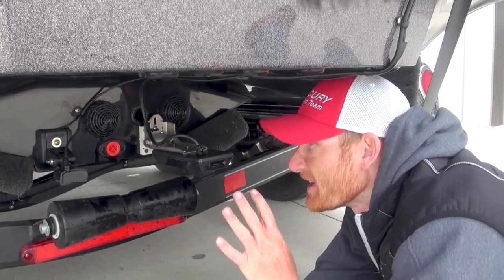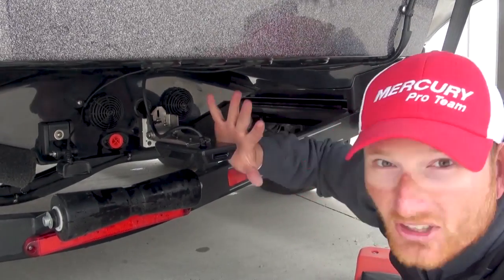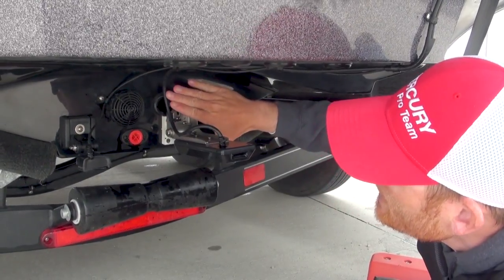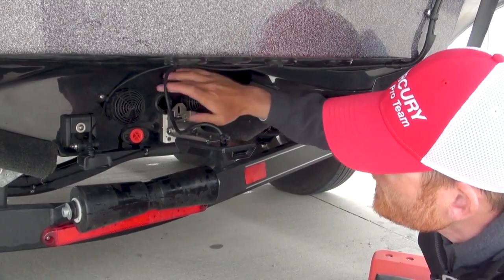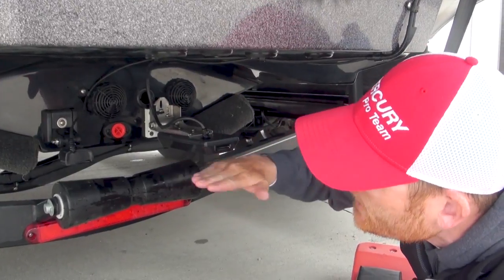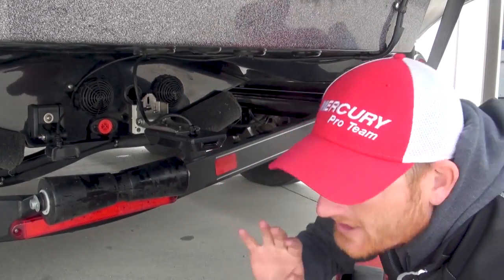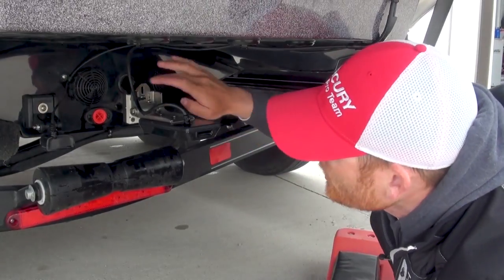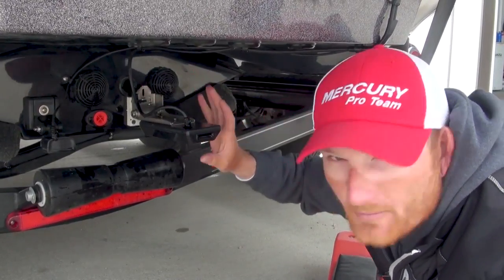It's easy to run out of space on the back of the boat, especially with the larger skimmers. Something like a piece of starboard will allow you to actually separate it from the hull so you can get around drains and different things and still get the height that you require. That way you're drilling into the starboard and not your boat, so you only have to have holes in one piece and you can make minor adjustments.